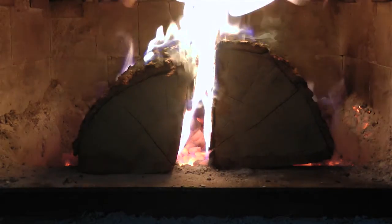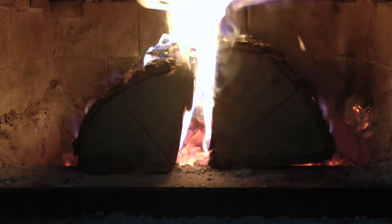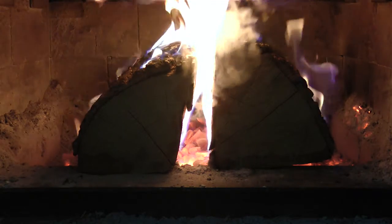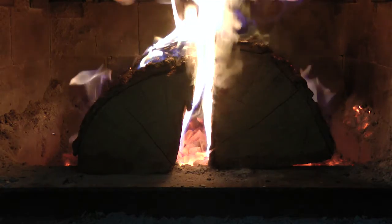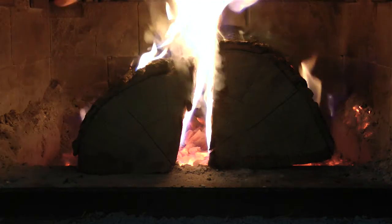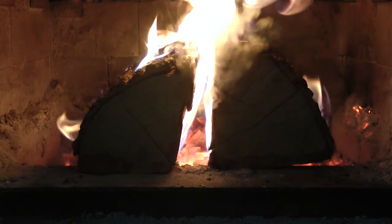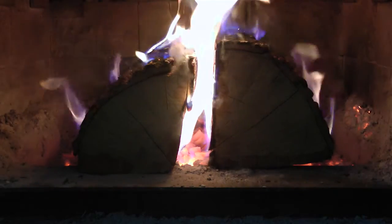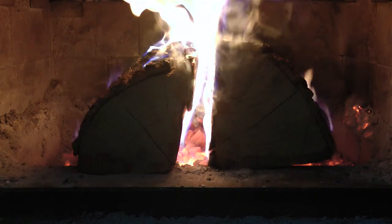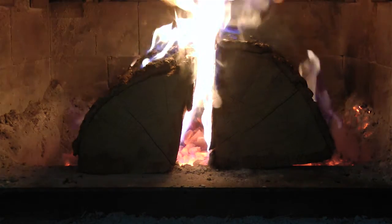This is the best configuration for starting up a wood stove — cleaned it out, saved the charcoal, and now getting it started again. You've got half-moon shaped split wood over a bed of coals, with a rising flame column between the two vertical faces. There's the chimney effect, where gas vaporizing from the superheated wood combines with air, burns, expands, creating more pressure in that gap, which makes it rise faster — continuing all the way up that gap. This is how you have your chimney effect.